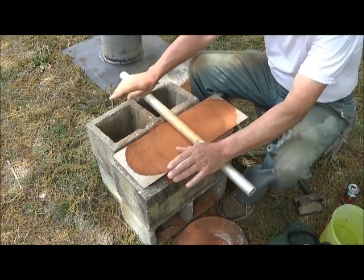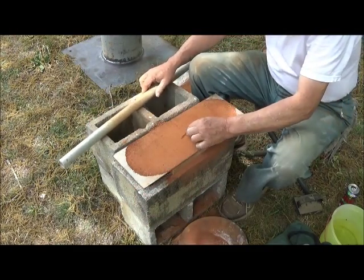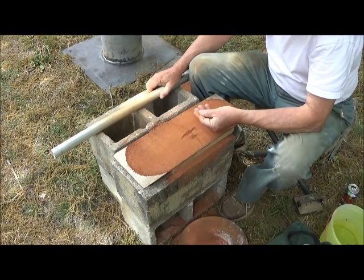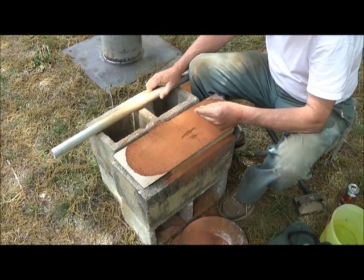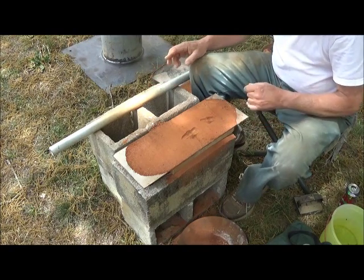Now we need to have some sand in this mix for structural strength of the clay itself. But I think we have just about enough. And the way you can tell, just rub it between your fingers and you should feel a little abrasion from fine sand particles remaining. We're looking for, in this particular clay, a silt-sized sand. Yeah, we've got it. Now we do have some coarser fragments too, which are not desirable.